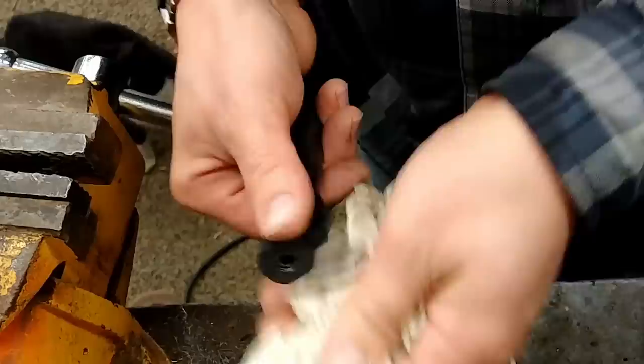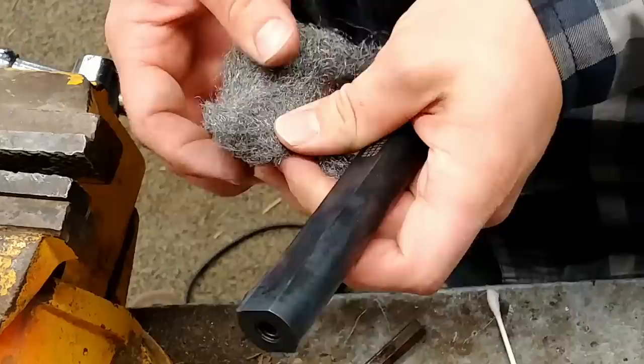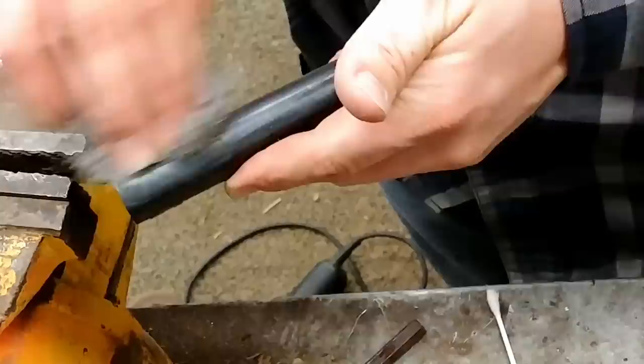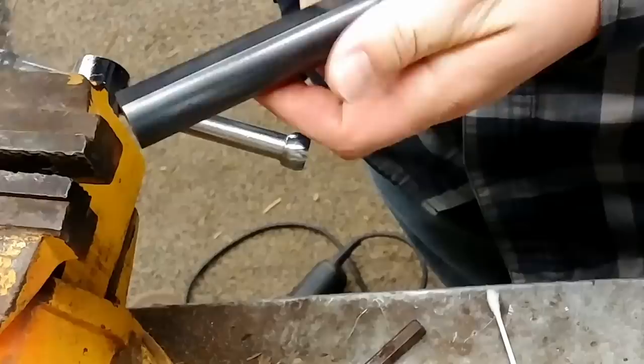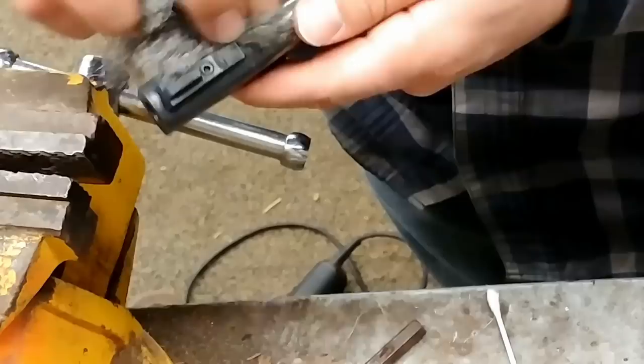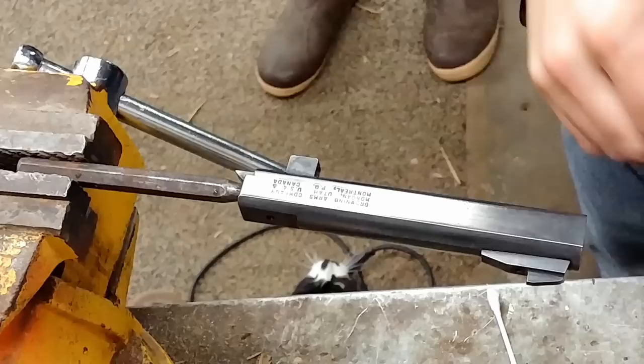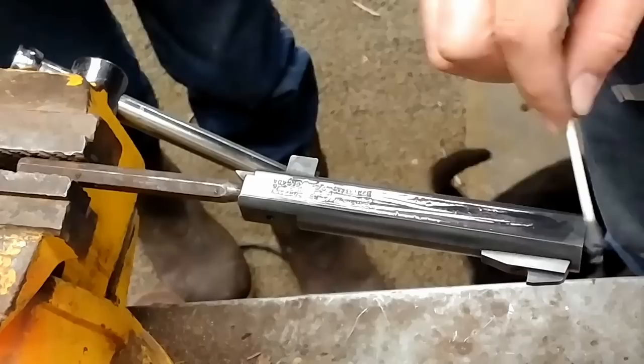It's a little bit blotchy but not too bad. Now, the finishing step is to lightly buff it with steel wool — that's what we'll do, I guess just to clean off the surface. Oh yeah, wow, that actually makes a huge difference. It leaves the bluing that's kind of ingrained in the metal and takes off the surface excess. So I'll continue to touch this up and then I think we're going to do a second coat — apply some more after lightly buffing it. You can see how instantly it turned dark.